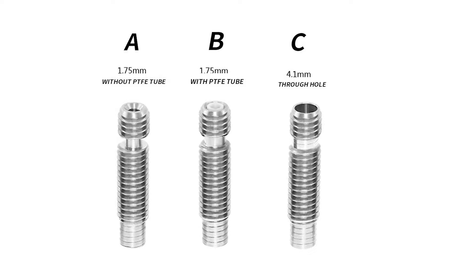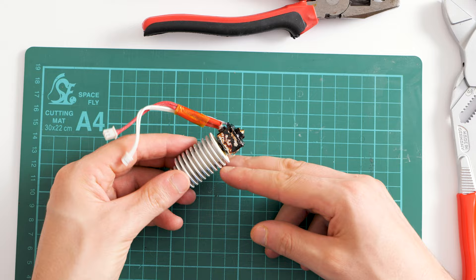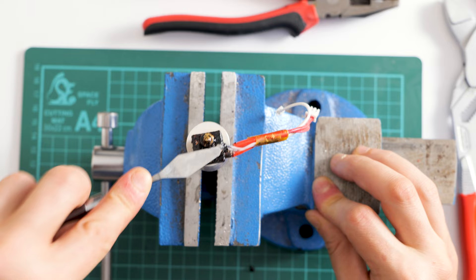Because of this, nowadays all-metal and even bimetallic heat breaks are preferred. I'll probably upgrade to one of these in the near future for my i3 Mega. You can see the state of this hotend - it's a complete mess. Let's see if we can try and clean it up. Unfortunately the plastic had melted into the grub screws, so first I had to remove that with some tweezers so I could access the screws and get the heater cartridge and the thermistor out of the heat block.